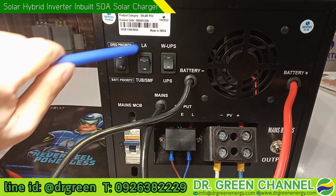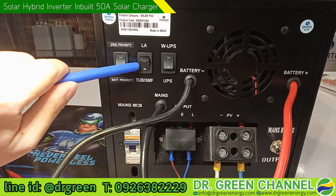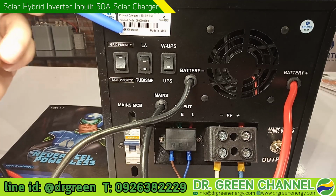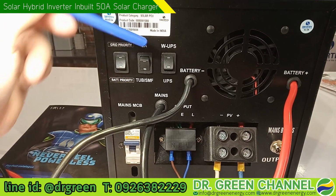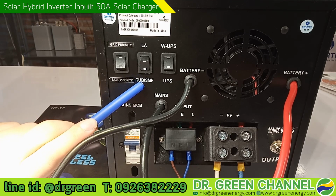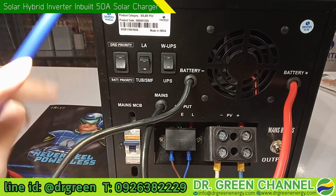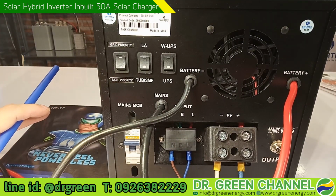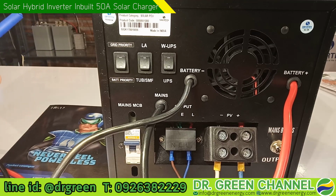Next is the switch to choose between the type of the battery. So whether your battery is the lead acid or the deep cycle, or using tubular or the seal maintenance free. Choose it correctly. But most of the time we are choosing the LA for the lead acid if you are using the deep cycle battery for the solar.